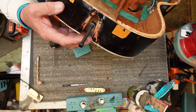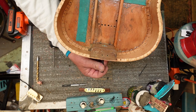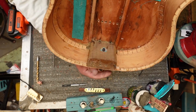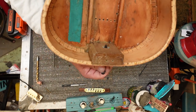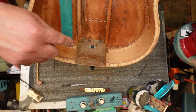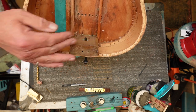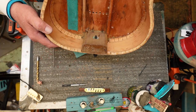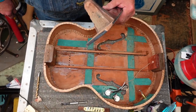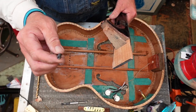Okay, so the way this works now is when you put the neck on, we're just going to turn this in, and you can see it emerging through that T-nut. And no matter what you do, pulling on it this way, the force is pulling against the T-nut, which will keep the neck on until this turns into petrified wood, and then you won't have to worry about it much now, will ya? Now, the hole that goes through the neck only needs to be as big as this, not as big as the hole we drilled for the T-nut.